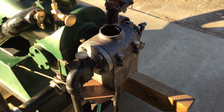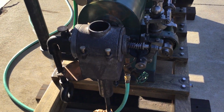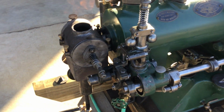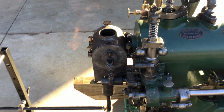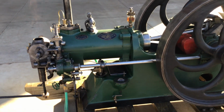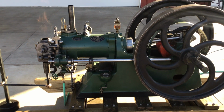This is an intermittent lamp engine, so theoretically while it's working you should be able to shut the cover up on the bottom, put the little cap down there on top, and you wouldn't need the flame going all the time. It's got a compartment in the bottom there with a bunch of little bronze rods in it to help hold the heat. The earlier ones, they called a continuous lamp, I believe, where you pretty much had to keep the torch going about full time.